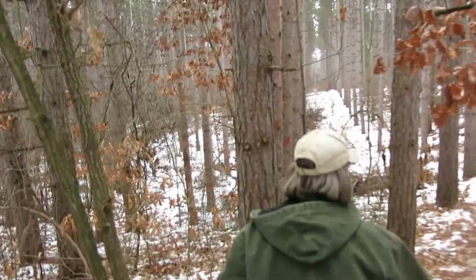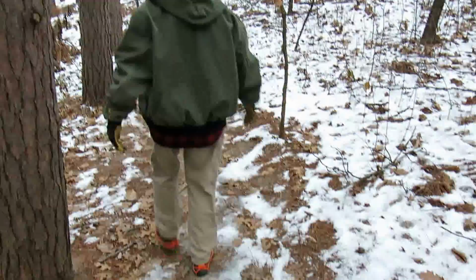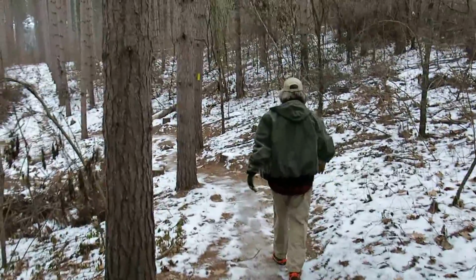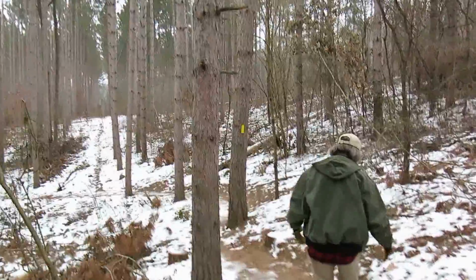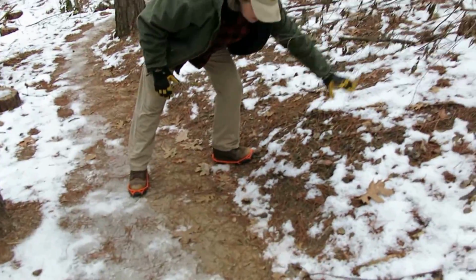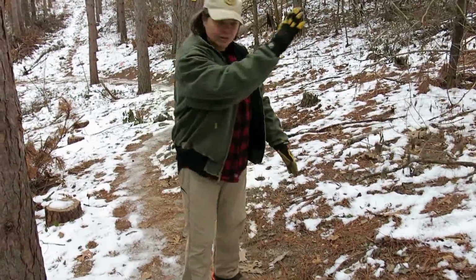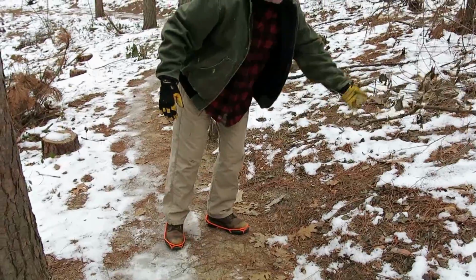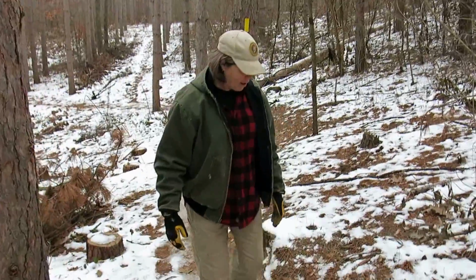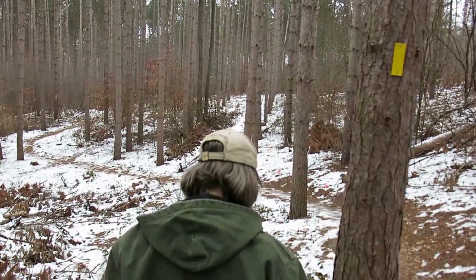So as you can see, this trail is going to allow water to go across it instead of down the trail. And when we build these, we not only set up a little outslope here, but we work on the back slope edge here as well, so that water doesn't wash out on there. So there's a specific angle of this slope along with the actual tread slope. Excellent. Did you go to a mobile skills training, Pat? Yes, I'm a mobile skills crew leader.